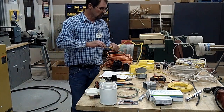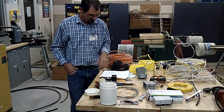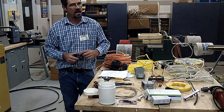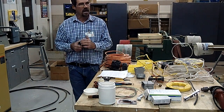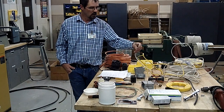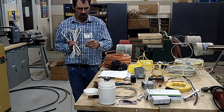In commercial wiring you're usually drawing a lot more power through your wires. Wire comes in different diameters for different amperage — there are codes on how many amps you can run through it. Do all of you have a breaker box at home? Depending on the amp breaker you're using, that tells you what size wire you have to use. For a 15-amp circuit, you use this white cable — this is 14-2 with ground, which means it has a black wire, a white wire, and a ground wire. There's also 14-3, which has an extra red wire in it.